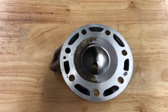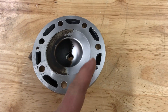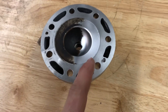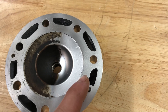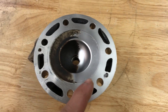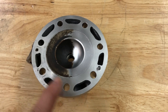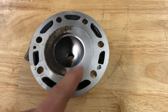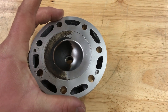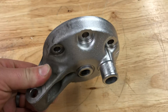Second thing — sealing surfaces. Is it safe on sealing surfaces? As you can see here, we've blasted this half of the part and you can still see some of the machining marks on the part. So we're not removing the material. It's not damaging the sealing surfaces over here that's been unblasted, and we're not rolling and eliminating edges on the part, so it's going to properly seal back and be put back into use.